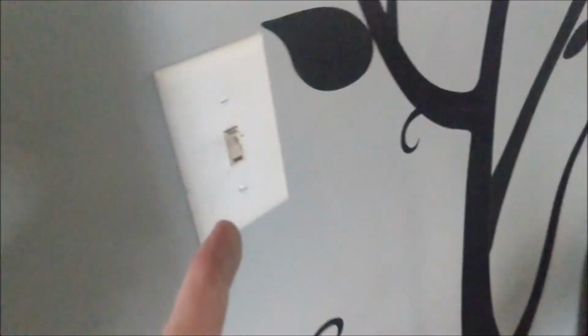And so now I'm gonna go ahead and wire this. The only purpose that this switch serves, since this used to be a solarium, and yes, those speakers do work, but they are original and they sound like shit, there was no light fixture in here in the ceiling, so this light switch literally controls that outlet and nothing else. So the way I'm gonna do this is I'm gonna wire it up so this switch will control my light fixture over here, and this outlet from now on will just be constantly hot.